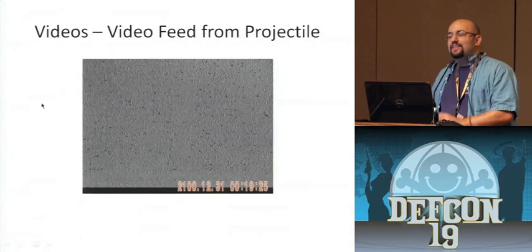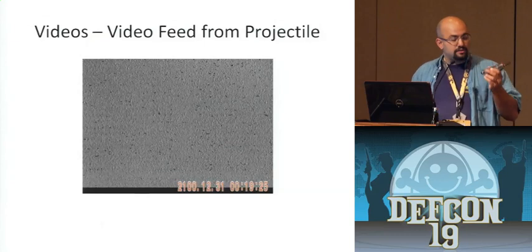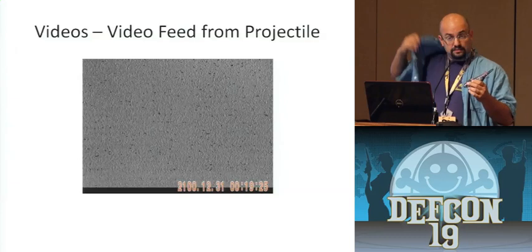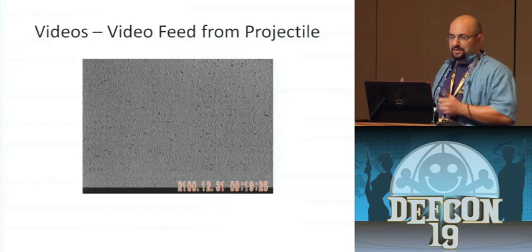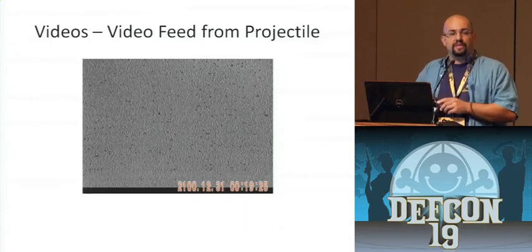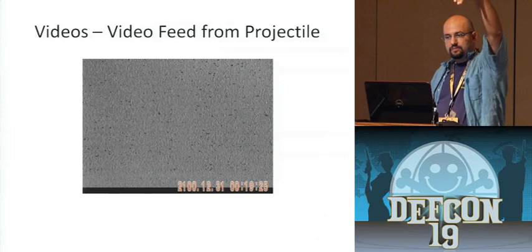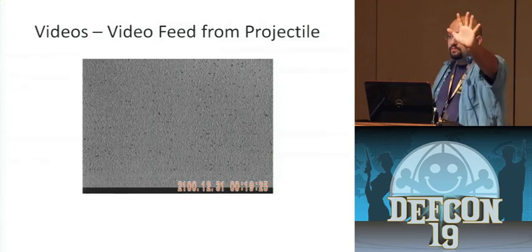The video feed from the small flight didn't work. We found out that these cameras are susceptible to motion. They're designed for surveillance, where they're going to be standing, like mounted or on somebody's person. So they're designed to be moved at human speed, not bang speed. Minor issue. But what we figure is when they actually get up in the air, so we're figuring on deployment, we're not going to get any video. But once they hang from the parachute, they're going to be descending at a much slower rate. We should be getting usable video from them. So we're not actually worried about that.